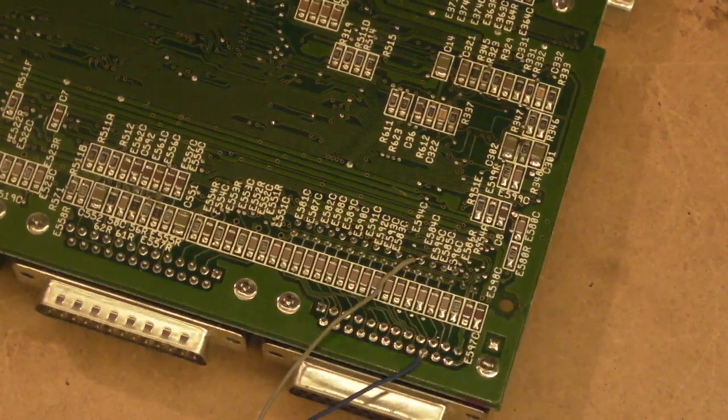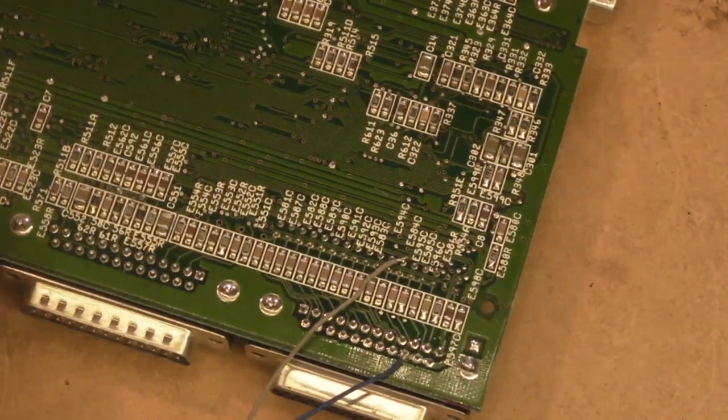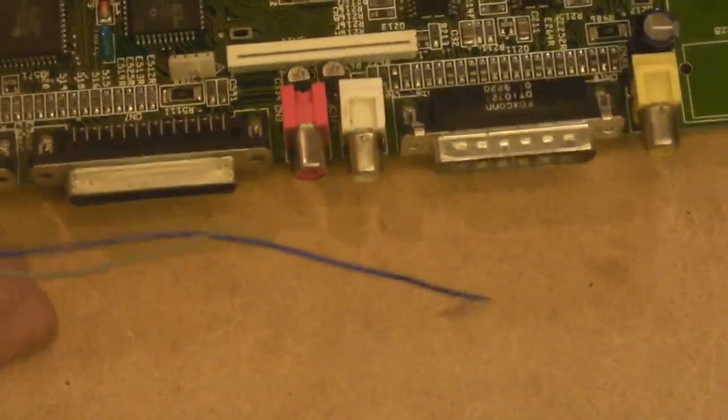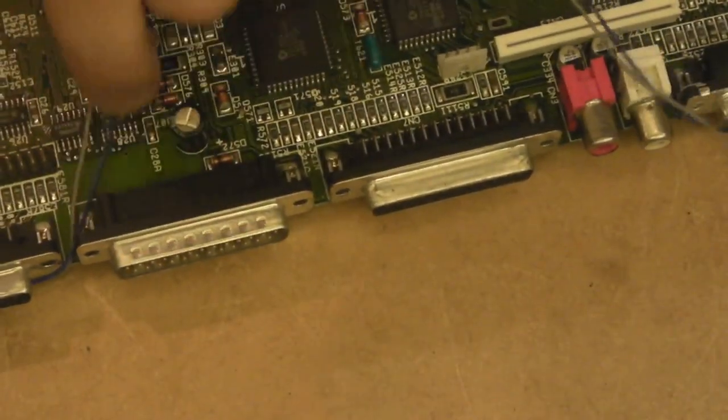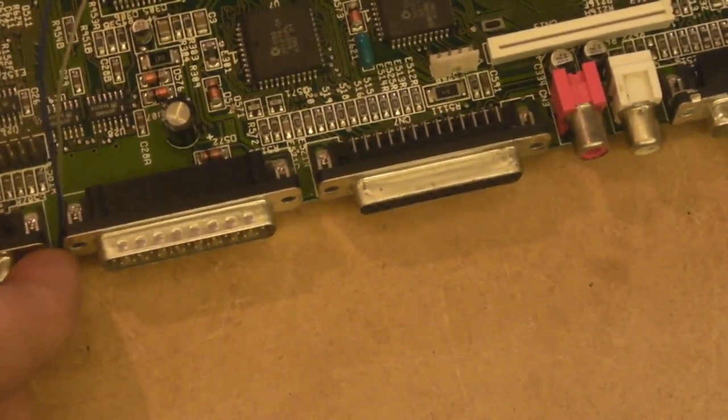The other mods are to the case and fitting the switch. I've soldered those two wires on there and I'm going to basically bring them through like that, because I am planning to put the shielding back on this — so I'll sneak the wires through and then put the shielding back on. Because of how I've soldered them nice and flat on the bottom, and the fact that the shielding has a plastic liner in it, I've got no worry about those two connections shorting out on anything.